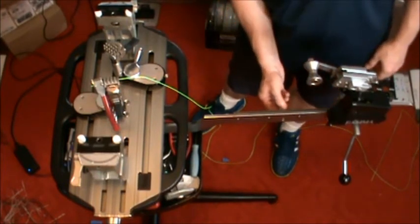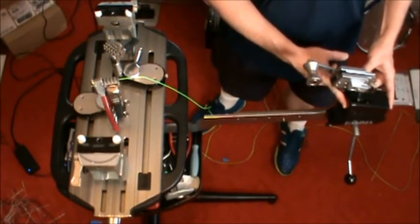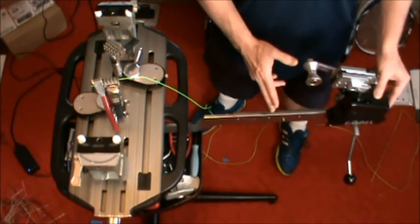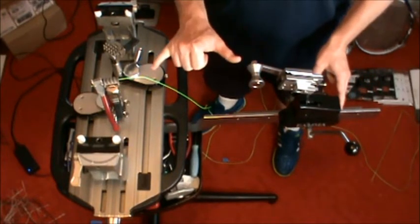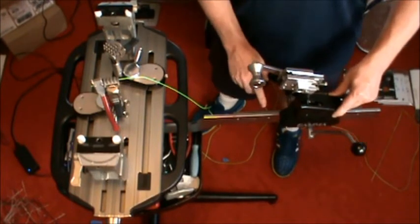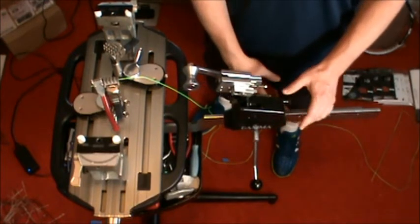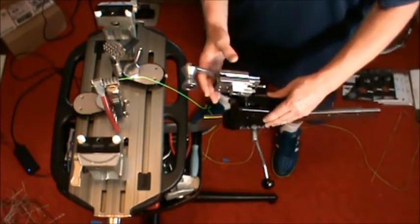Otherwise, if you turn the knob 90 degrees, it's a little spring-loaded knob. Its intended purpose, when you have this stock crank mechanism on there, is that it prevents this from going too far forward into the racket that is mounted, and it also creates a stop so that every time you tension a string, the distance from the racket to the tension head remains the same. If you don't have this engaged, then this will continue to travel right up against the racket if you wanted it to. And there are some machines that don't have this kind of stop mechanism. So like a Prince Neos 1000, you can get the tension head all the way up against the frame.